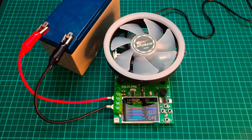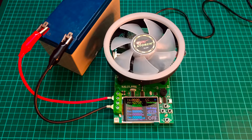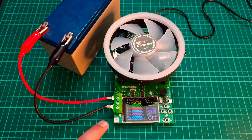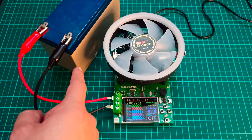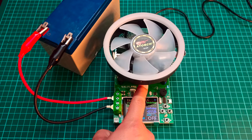As you can see, I have connected this 12-volt dry battery with this battery capacity tester — it has a 9 ampere-hour capacity. Whether you have a new or used battery and want to know how much capacity is actually left, all you need to do is charge the battery completely and connect it with this capacity tester. The current you want to draw is labeled IS, and the actual load is a transistor or MOSFET under this heat sink.